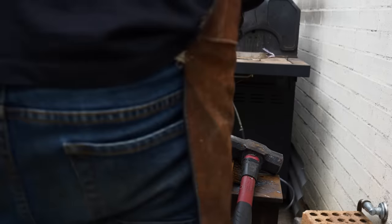This is the wooden handle I'm using, which I crafted earlier while you were watching the rest of the video. And because I'm not happy with the axe head, I'm going to take the approach of every family that owns a house in a rough area and overcompensate by blinging it out as a distraction. But first, I'm going to attach the head to the handle with a wedge to stop it flying away like my last axe. Now I'm going full Viking and will do a leather wrap down the handle with some shiny nails. To be authentic, I got my leather straight from the source and went down to the supermarket and bought it from right next to the steak. And as I'm twisting the leather down the handle in a cross pattern, I'm using little nails to crucify it in place. And now for the finishing touch — something to catch your eye, but not like my last video.